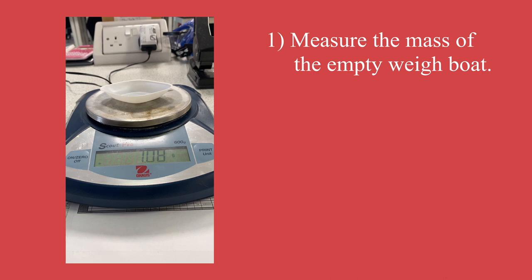When I say I want to make sure the balance is tared, I'm going to make sure the balance reading is at zero before I put the plastic weigh boat on, and I'm then going to take a note of the weigh boat's mass. You could tare the balance after you put the weigh boat on so it reads zero with the weigh boat there, but in between measurements maybe someone will go and hit the tare button — then you don't have the mass of your weigh boat. So it's quite important that you do it this way around, so you know exactly how much that weigh boat actually weighs.